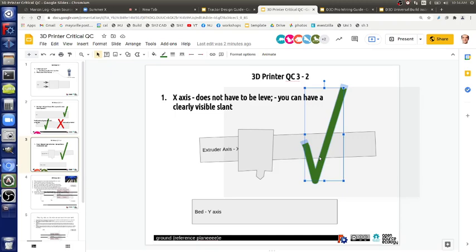So I would say the limit is, we can get more explicit about it, but I think it's probably more like 1 millimeter that we can have that setting be off and still get quite good prints. If you have a 0.4 nozzle, then that distance would be more like 0.3. So it's actually harder: the smaller nozzle you have, the harder it is to get it to print exactly right. Because if you're above 0.4, it's not sticking to the bed. You have to have a little bit of physical contact.